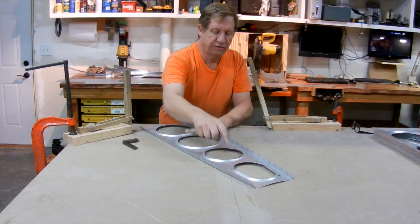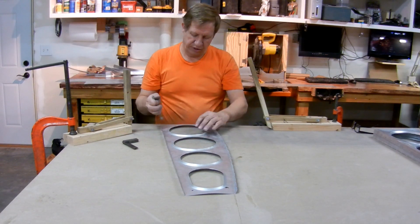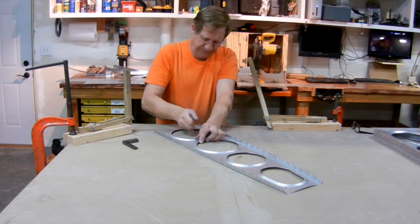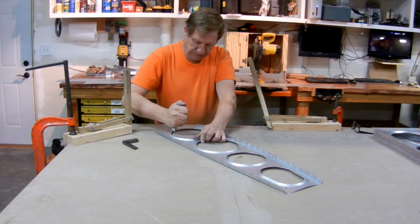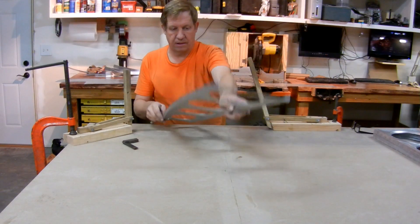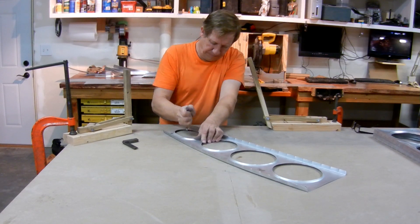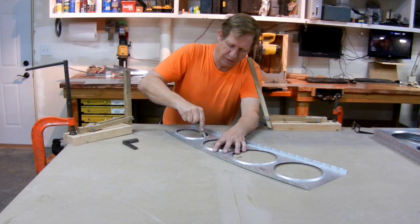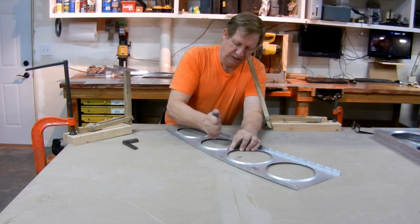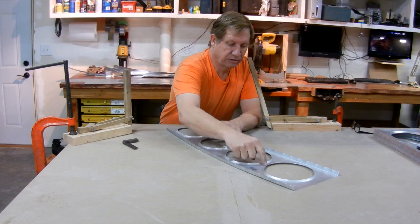As you can see, I've already lost a bunch of the bow in this direction. I'll get to that end in a second, but we're starting to pick up bow the other way, which is how it goes. That end is almost flat now — it needs more in the center. I'm not going to get it perfect right yet, because once you take the other bows out, you'll find out that you're not perfect.